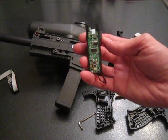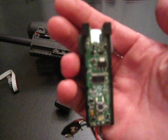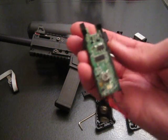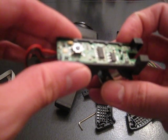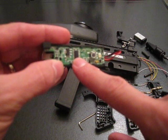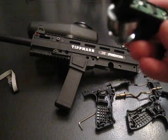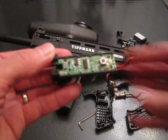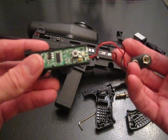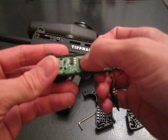This is as far as you need to go for tearing your gun apart. I know we just disassembled the entire trigger, so that's pretty far, but no soldering required for this. We'll be taking a closer look at how to identify the pieces on this trigger board. This is the main chip that you'll be programming. If you look very closely on it, there's going to be an indented circle. The solenoid will be on the left, battery supply on the right, and the top left will be pin one.